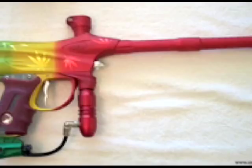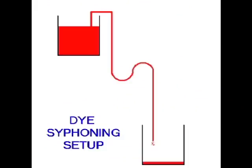The fade dye technique, once mastered, can produce some incredible effects. The most economic way to accomplish a fade is to use two tanks and siphon the liquid from one into the other. This provides a fade with no lines, unlike hand dipping the item. Controls can be introduced by watering down the dye and altering the flow by changing the pipe diameter. You will need to do several practice runs to become accomplished at this.